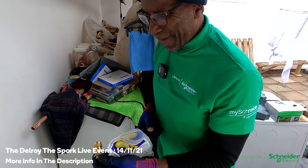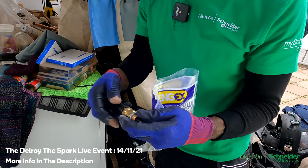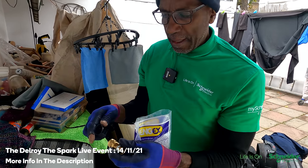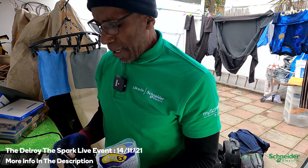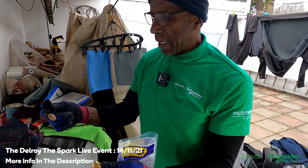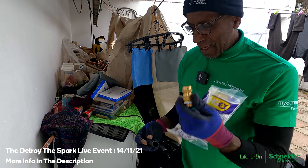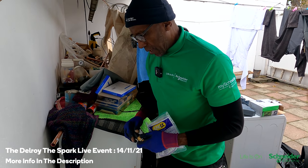It's a bit belt-and-braces because you're going to have the cover over it anyway, but when you tighten it up, it seals it — you've got the seal inside to seal it properly. A lot of the times you go around and see the shroud not properly on there. I always use weatherproof glands when working outside.